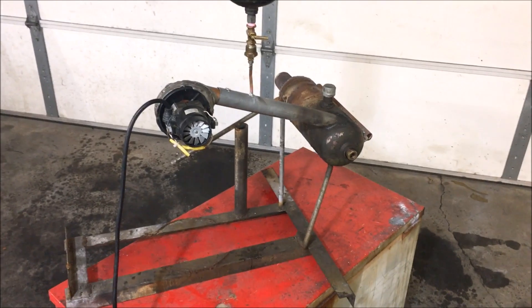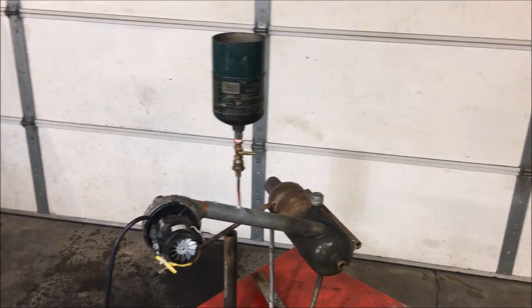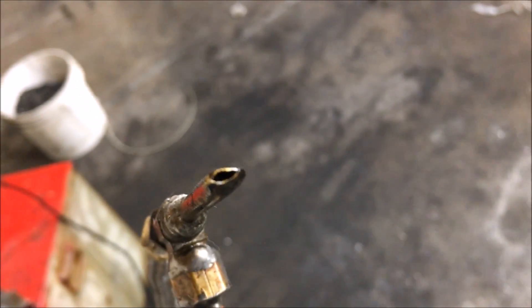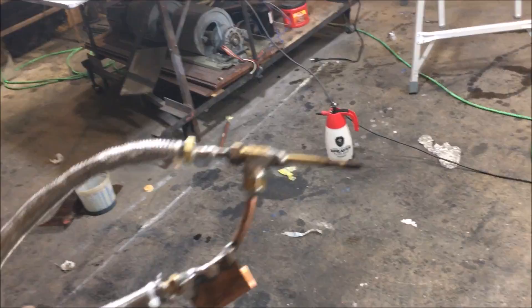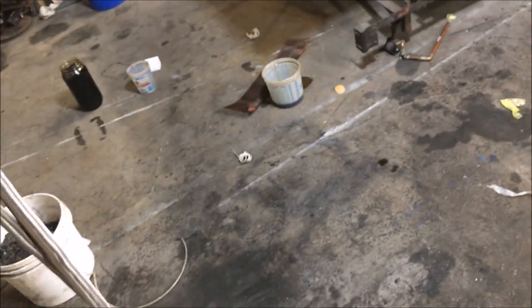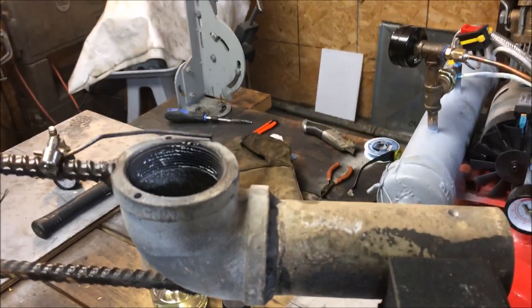That is about the gist of it. This is definitely going to be the easiest build for you Steve. I highly recommend you stay away from spray nozzles unless you've got a lot of equipment already, like a couple of air compressors. This little nozzle right here has a little air spike inside and the oil travels through the outer sheath — nothing sophisticated about this one. This one uses very little air and does not need an oil pump; it siphons. It's an actual working siphon nozzle that atomizes the fuel very well, and that's what I use to run this thing.